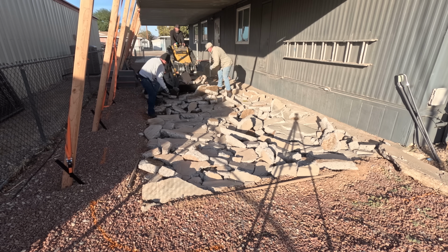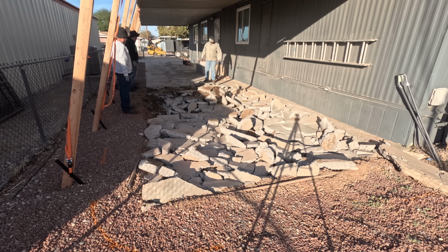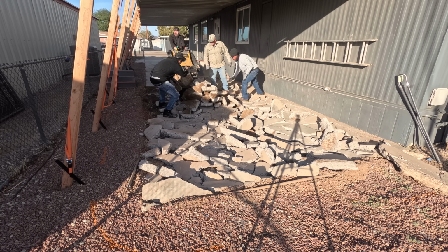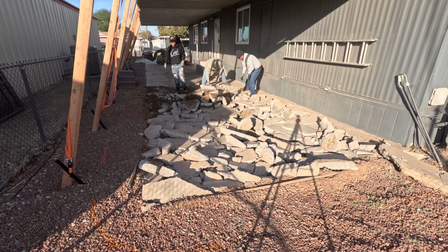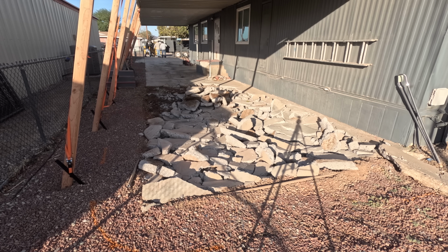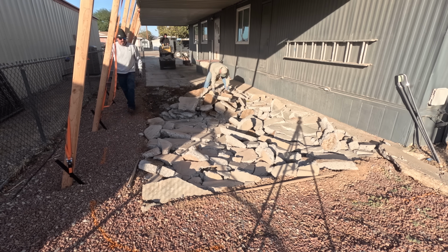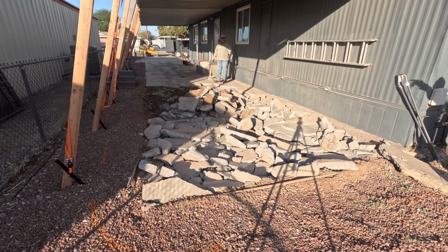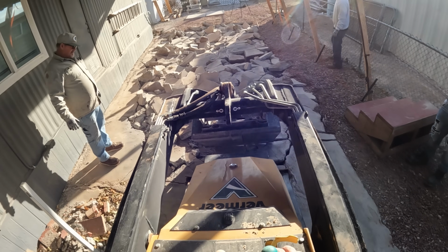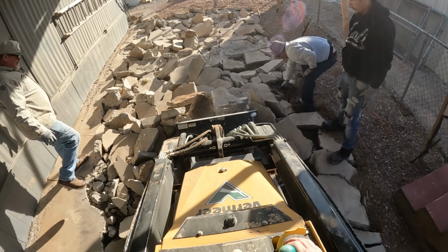So what we're going to do is set a stem wall, 4-inch high monolithic pour stem wall on the outside edge. And then we're going to do little notch outs in that stem wall so we can get cross slope away from the house, and it'll just come through beneath the top plate that's going to be holding up this awning. You'll get to see that form and setup in this video, how that works, and worked out really great.